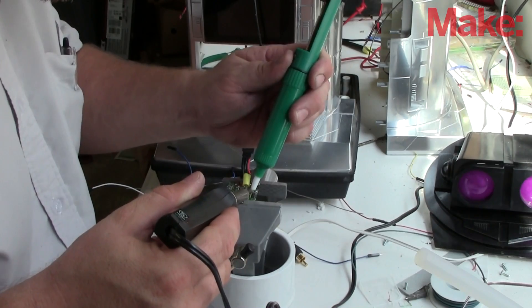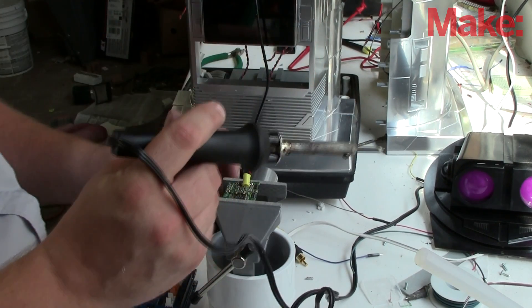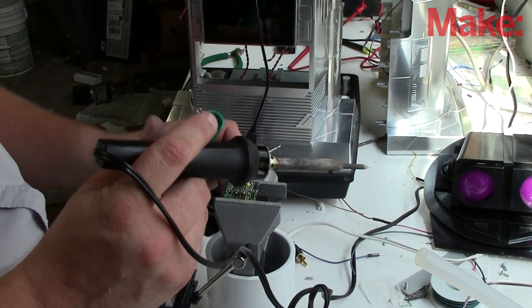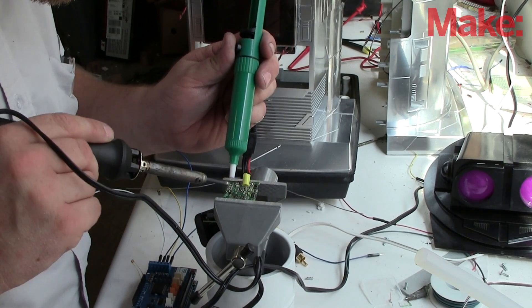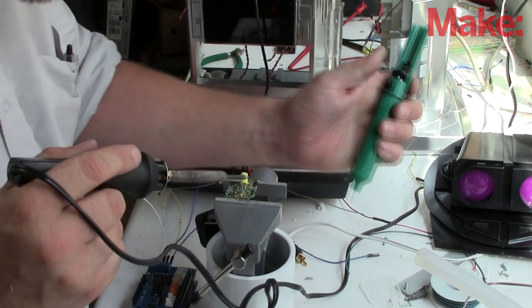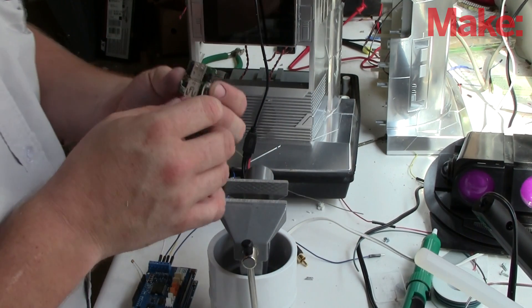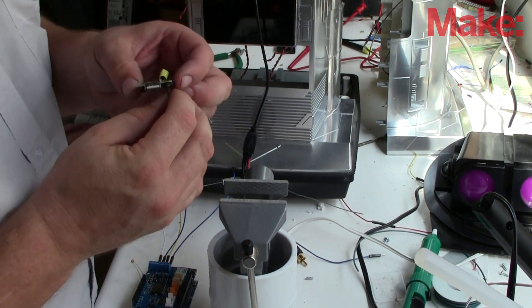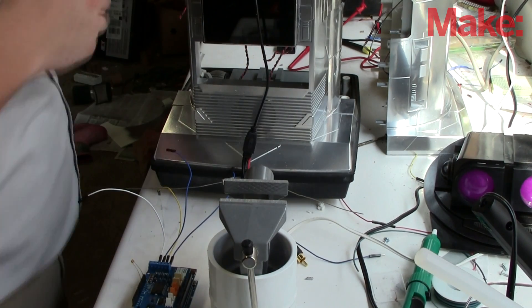To give a good connector for the Raspberry Pi without having to cut any wires, I hacked into the power cube that came with the Pi. I pulled off the AC portion of the circuit, but before I did so I measured and found that there was 5 volts coming from the AC portion to the DC board. Therefore, I can take the output of my BEC — the 5 volts — directly into the same board. Then the Raspberry Pi can still use its USB wiring to plug in and get the 5 volts for power.